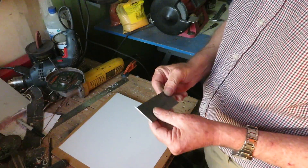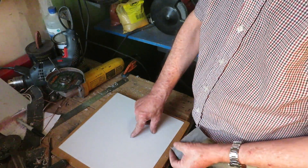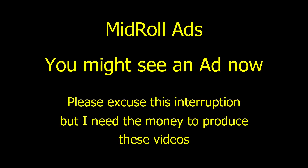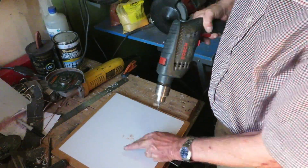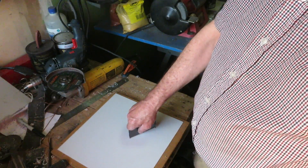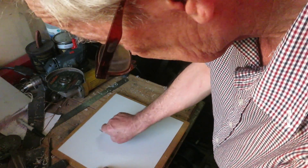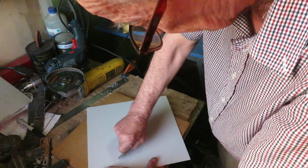To work with this tool is very easy. As it has an axis of 2mm diameter, we make a hole with a bit of 2.5mm. That is the center of the circle we are going to cut out. We start with a soft motion marking the circle — we don't want to go deep at first. Once we've marked the circle, we can go deeper.